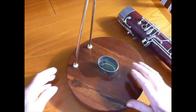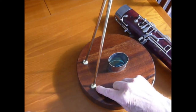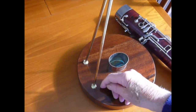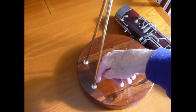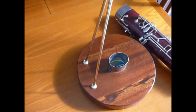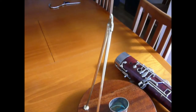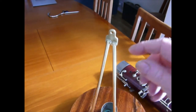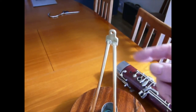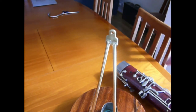A bit of a problem with the brass rods is that they've got to be drilled through at an awkward angle, a double angle really, because you've got to come in from this direction as well as an angle here. There's an angle on the inside. However, it's amazing what you can do with careful eyesight and lining up, and it does match quite well. And at the top end of the support just here, the brass rods are half lapped and silver soldered together.